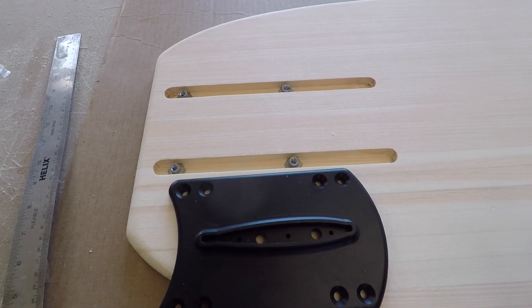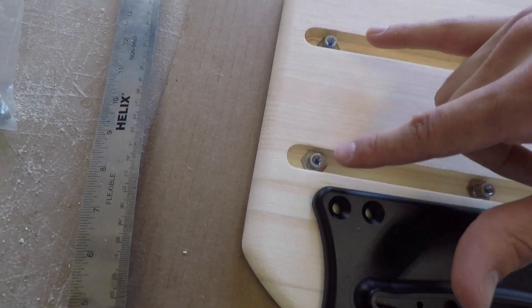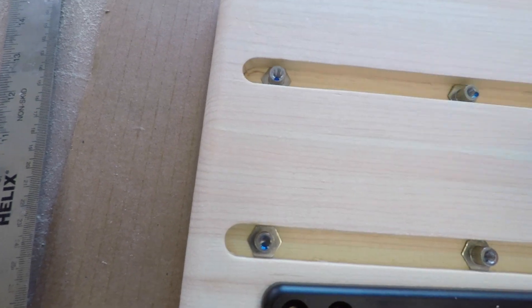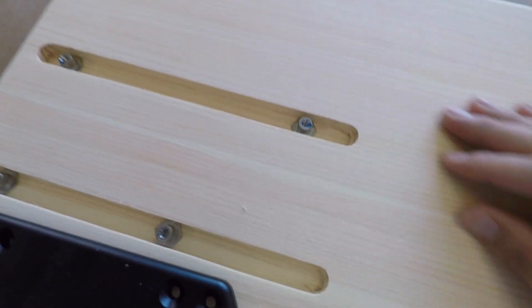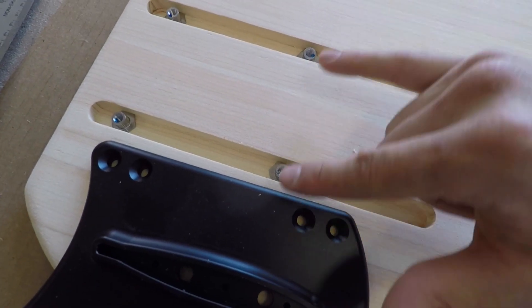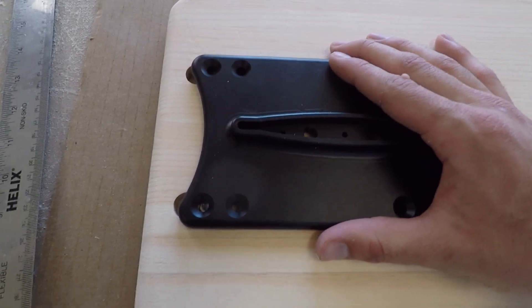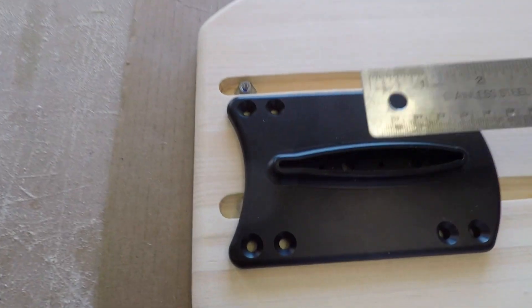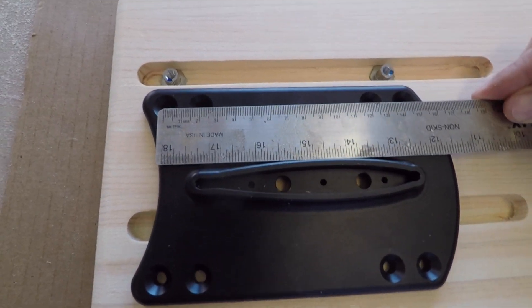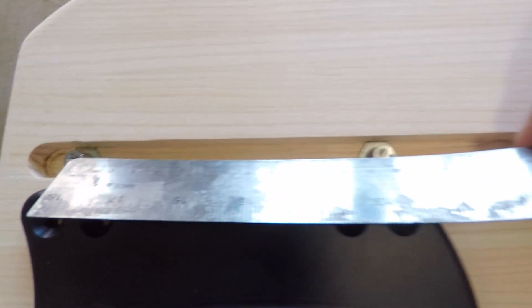This is the three-foot board I'm using for this example. The first step is determining the spacing of your inserts. I already have these two spaced 20 millimeters from the very back edge of the slots. They slide — it takes some effort because they're very tight fitting to keep that 90-millimeter space. You want to slide them to fit the aluminum base plate. The outside to outside is 140 millimeters, so I'm making sure these inserts are exactly 140 millimeters apart.